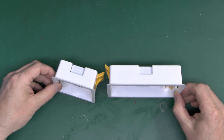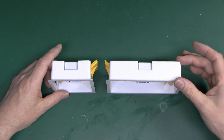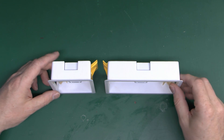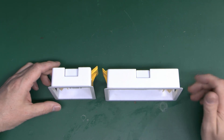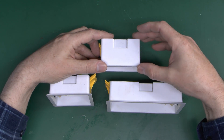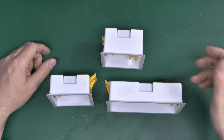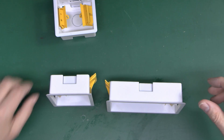Now in terms of the depth of these, these are about the shallowest ones you can get. They tend to be a bit deeper than the metal ones because in a wall that's pretty much going to be empty and hollow, it doesn't actually matter too much with the depth, so there's not as much choice. You certainly don't get those silly thin 16mm ones. You can get deeper ones like this one, which is definitely a 45 or 47mm as we saw on the metal ones.